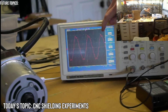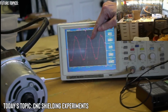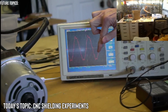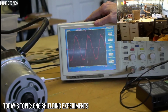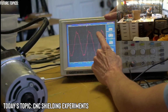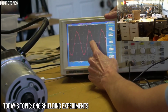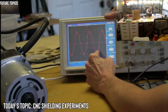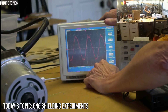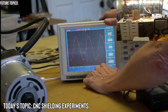It's got like a sub wave. It's got a different frequency wave in it. And I would have to try to eliminate the main wave to be able to see that smaller frequency, but it's regular. So we could probably count how many ripples there are in this. Let me see if I can get in here. So from peak to peak, I'm going to count this second one, then I'll go to the last one. So it's 1, 2, 3, 4, 5, 6, 7, 8, 9, and 10. So there's 10 times 60 is 600. So there's something that has 600 hertz in the atmosphere somewhere.